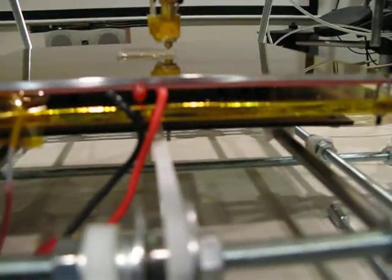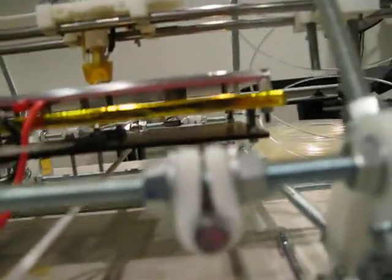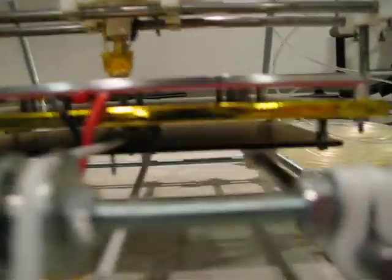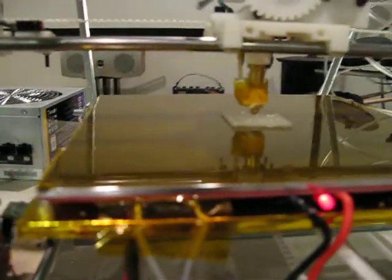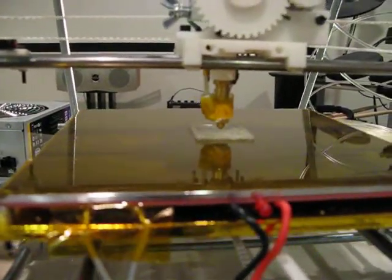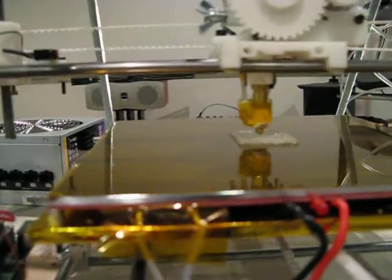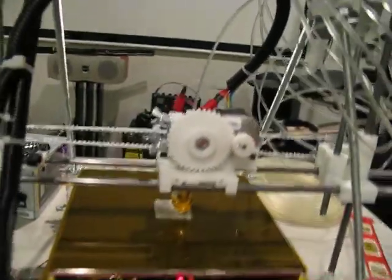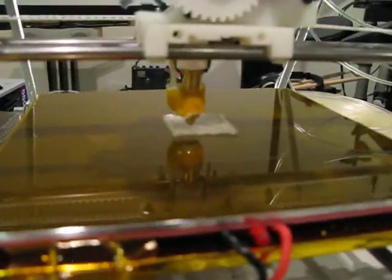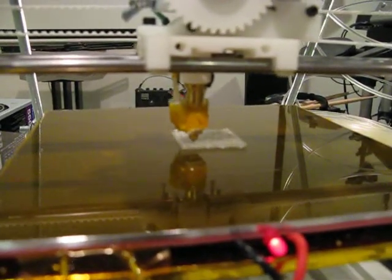I've got the wood base with heat shield material, then quarter-inch aluminum standoffs — air being a good insulator — then the printed circuit board itself, sandwiched underneath a layer of 1/8-inch thick 7075 aluminum sheet, and that is covered in mylar tape or Kapton tape. Kapton tape helps as a printing medium, allowing the object to stick and later be removed from the bed.